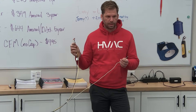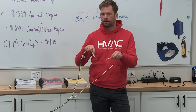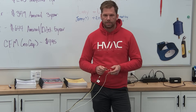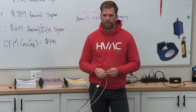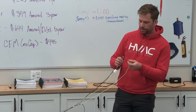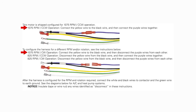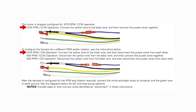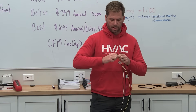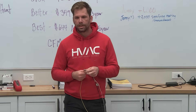For a 1075 application, you just have these two wires — we don't have a capacitor. This will go on to the defrost relay, or it doesn't matter, it just needs to be hooked up to the 240 top of the contactor. If you don't have the defrost, one side of the contactor and the board just needs 240. The tag says: connect yellow and black for 1075 RPM, disconnect yellow for 825. You pull yellow off — you'll need pliers because they're really good connections — and then you have 825.